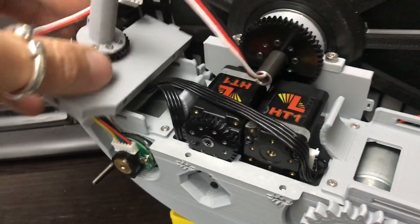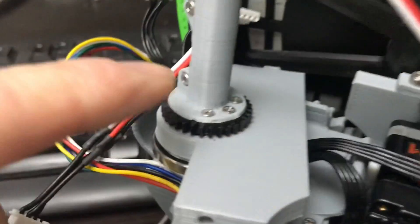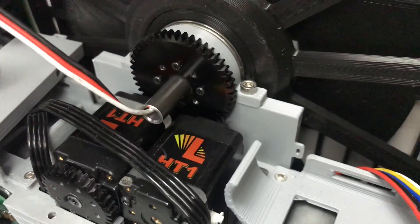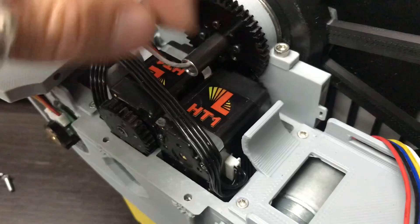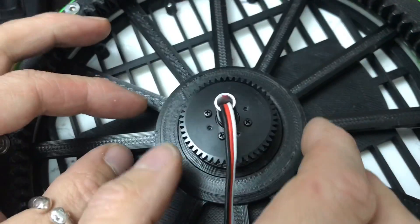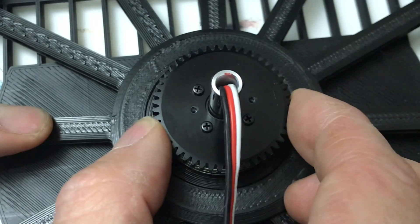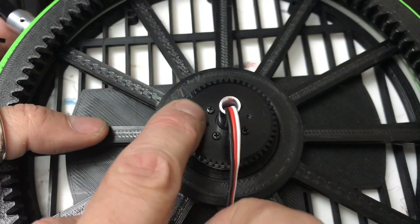I noticed there was a lot of slop in the servos on the neck pitch and the head pitch that I hadn't seen before. When I took them apart, one of the screws had worked its way out and dug into the back of the servo — which I think caused the other screws to loosen off. All that play was actually the servo moving. So I'm going to put some packing down the side of the servo so that if a screw is loose it can't move that way. This cog also had some play in it where it joins the axle to the neck — the screws were slightly loose. So it's worth going around and checking everything is tight.